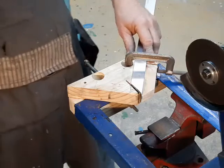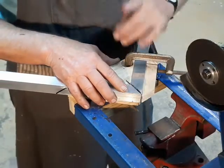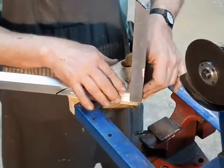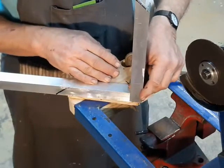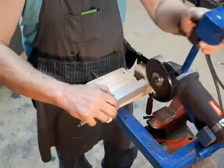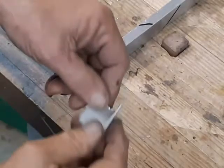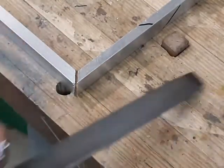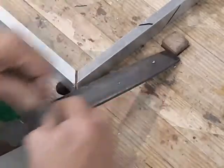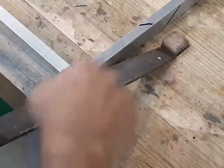By this time I'm sure somebody has asked what he's going to do with that hideous miter joint. Well, I've been doing this too long to paint myself into that kind of corner. What I'm going to do is slice off small pieces of the scrap angle and it's going to go right there like that — got a fairly nice treatment for how to put it all together. Cutting with the abrasive wheel leaves a pretty ragged edge with all this flash around it, and it's a little tedious but it doesn't take long to dress down each edge so that when we go to mark for drilling the holes we'll have a nice clean line to measure from.